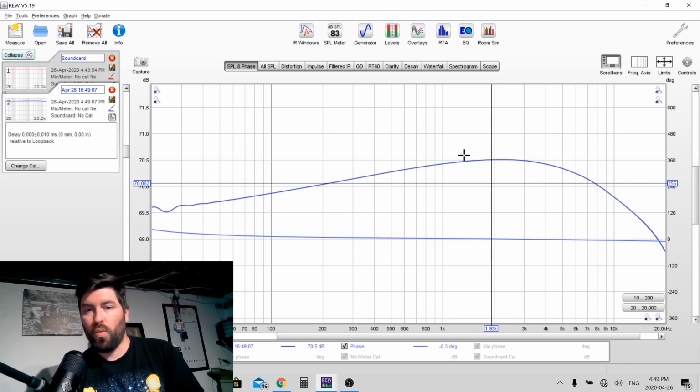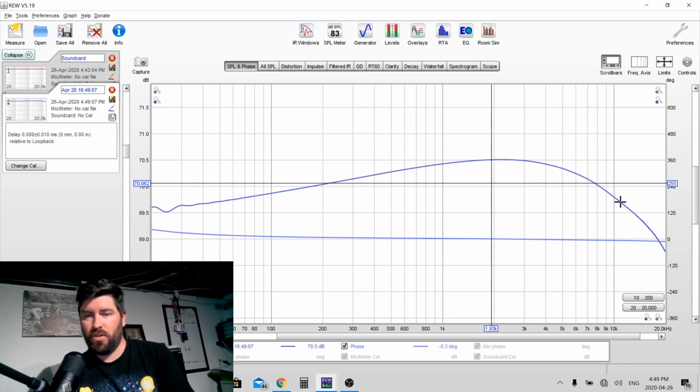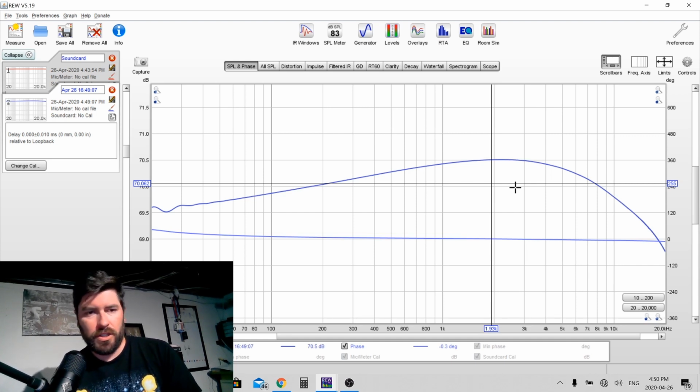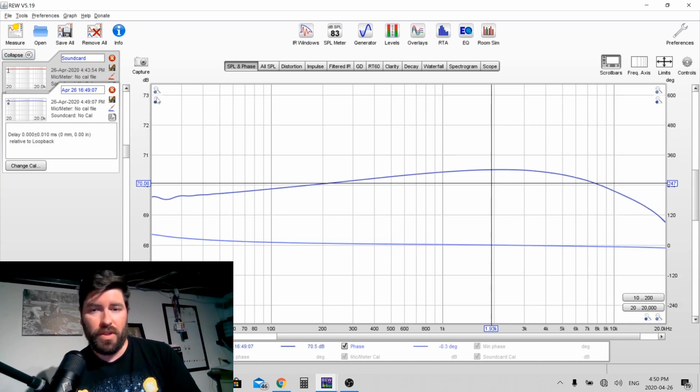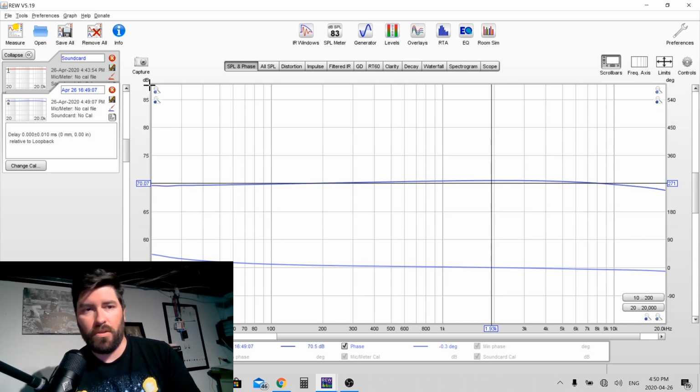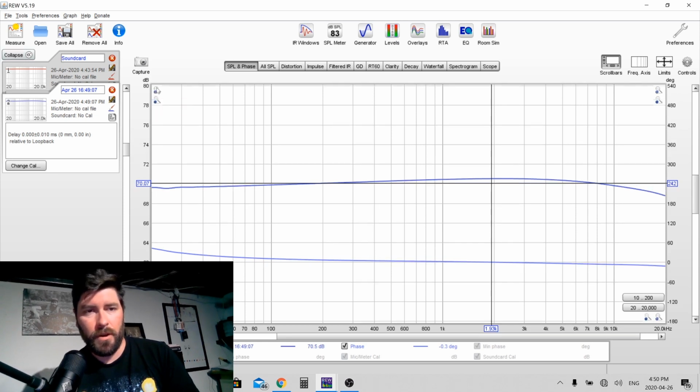We're within a dB pretty much all across the whole range except for the top end. And note that right now I'm doing this through a unit that has just been serviced. All the components have not been burnt in yet, and I'm still not quite done calibrating the whole thing. So that's just for reference. But basically, we can see that it's pretty damn good, flat all the way across within 1 dB. As I said, if I put that like this, you'd say, wow, this is amazing. But then we're in 5 dB increments on the grid, so it doesn't really make sense.